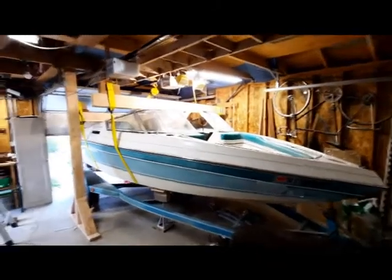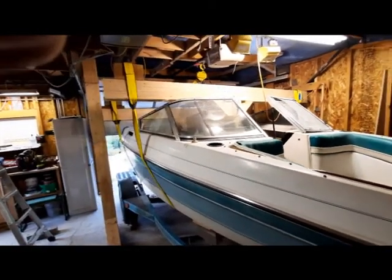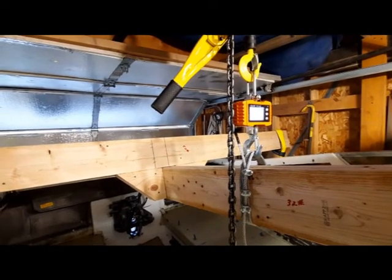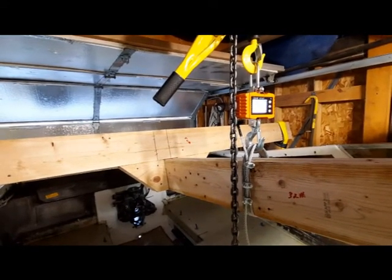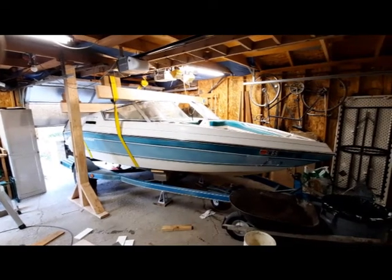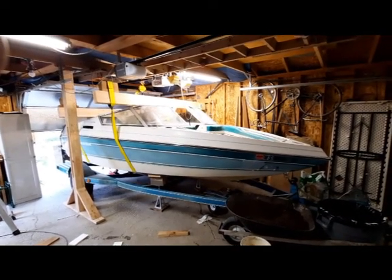She has broken the bonds of earth. The boat is now hanging on my sort of jury-rigged hoisting arrangement here — no comments on that please, I know it's jury-rigged. I did get the scale in there. See if you can make that out — 1,417 pounds. It bounces around a little bit, I think because I'm leaning on it. But that was really good to see, because the design weight of the boat with the gas engine is about 2,300. That gives me 900 pounds for batteries and such. I also have the interior out of the boat, which is a big chunk. So that's a good day.